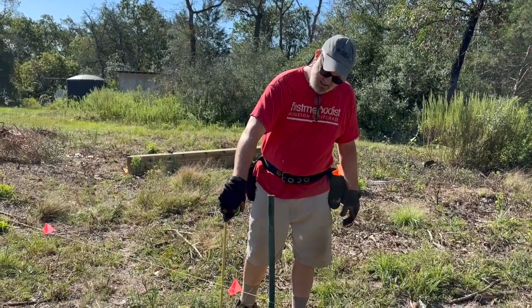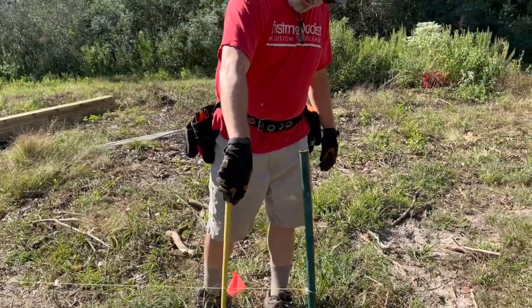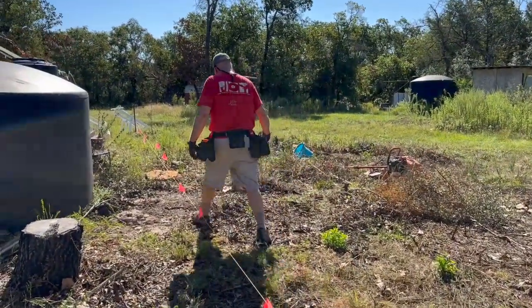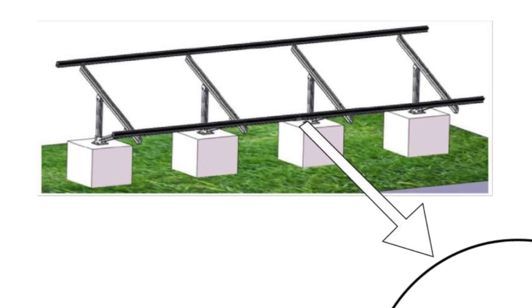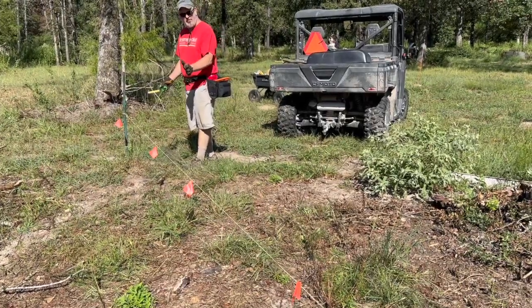Take your time determining where to put the post bases for the bright mount rack — each rack requires four posts. The bases of the rack are around 4.5 by 5 inches, so you'll need at least the top of a 6x6 post at 5.5 by 5.5 inches. The manual suggests rack feet be spaced 51.2 inches apart, but if you're using the extension kit add another 5 inches to length and adjust the feet out a few inches wider. Start with each pair of base feet about 52 or 53 inches apart, and remember the distance between the outer post of one kit and the outer post of the second kit will be much closer to 36 inches. Measure twice and flag your holes before you start digging.